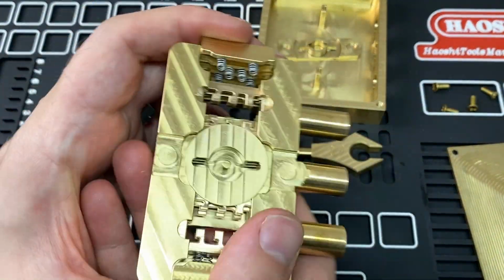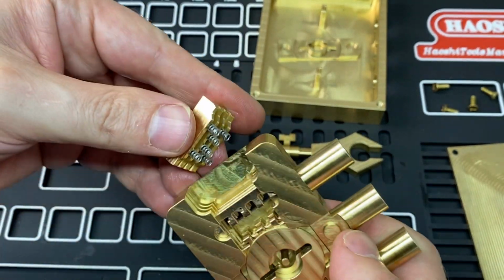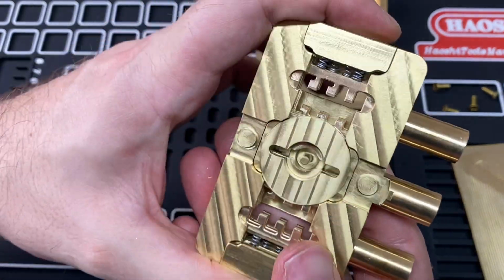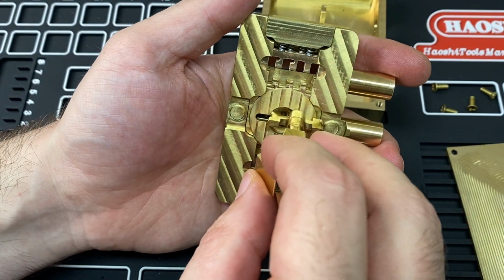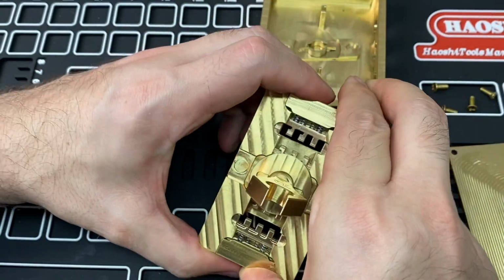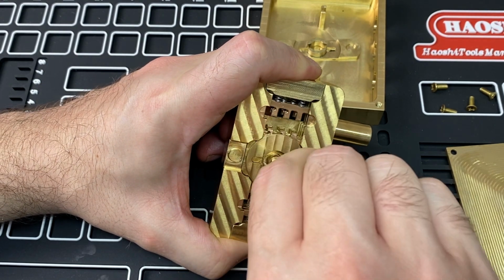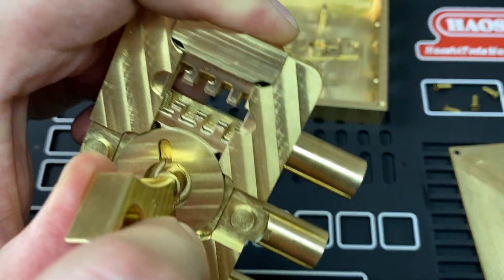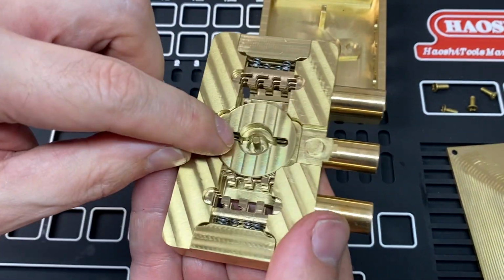Then we've got the cassette. If I turn it around, you'll see how it all works. So we've got two springs per wafer, and those springs go like that and push down on these wafers. So you can see that they slide up. If I was to put the key in here, so if it was going to go in and move it up, you'll see how what's happening is that this center section, if I hold it here, turns up, and I'm moving the wafers to their corresponding heights. Can you see that? There you go. So you can see the bellies of the wafers there.